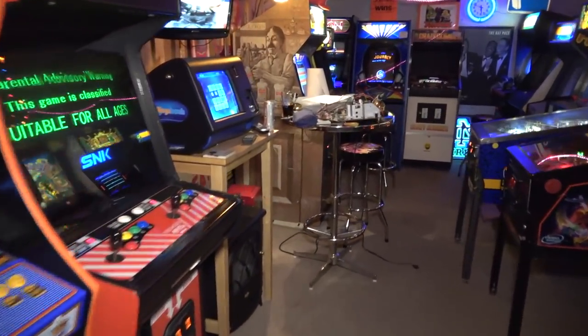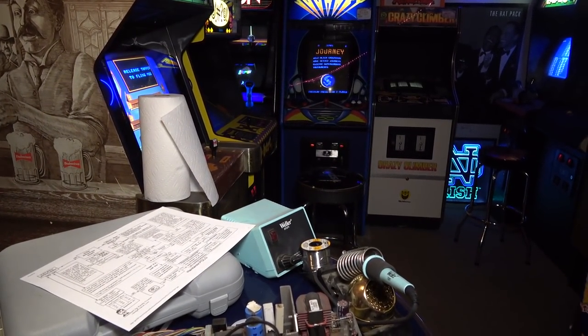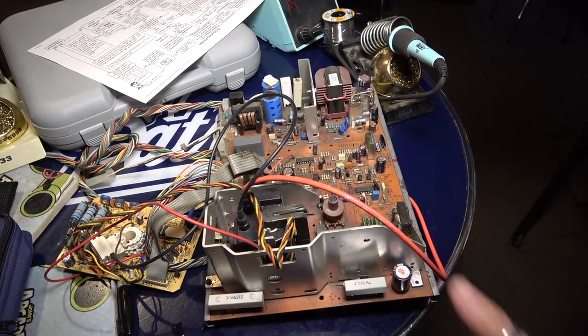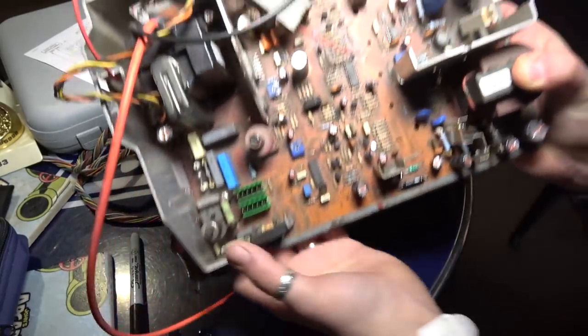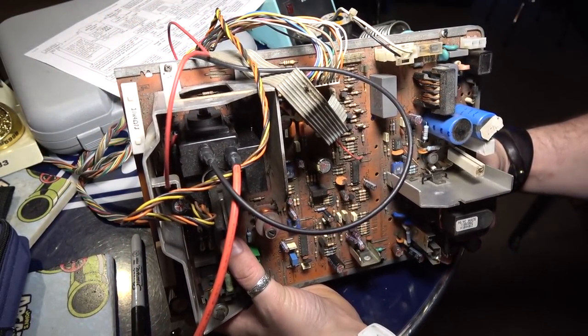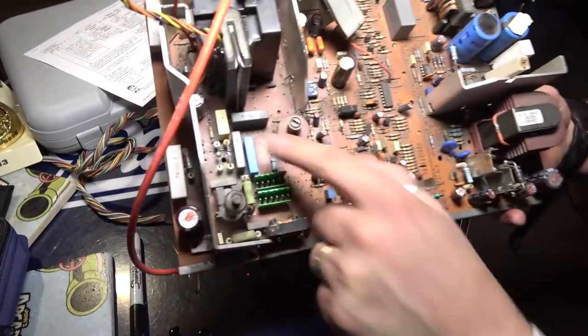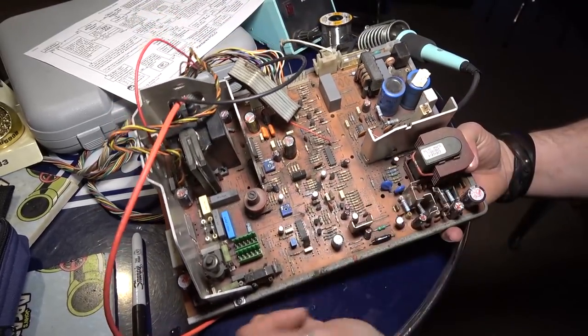And again, when I was in the UK at Arcade Club, the tech said to me, hey John, I saw your video, I saw that your Polo was in shutdown mode, it's ticking, you really need to look at these caps over here, okay? And then also, there was a gentleman on YouTube, I think his name is Sunken Canoe, he did a video on rebuilding a Polo, and he replaced one of these film caps over here, and it also fixed his shutdown problem.